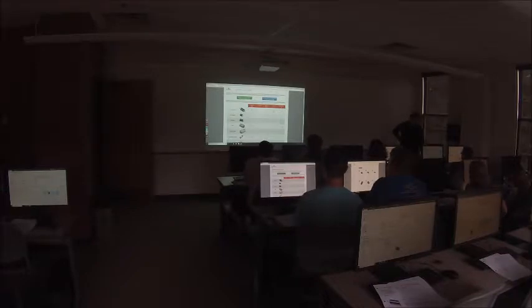Now, in addition to that, we want to know the free load current, basically how many amps of electrical current is drawn when the motor is just running at free load speed. As far as I know, that current basically represents the amount of energy that's just being lost in the motor to heat and to friction internal to the motor. Because if I'm not mistaken, if there were no resistance and if there was no friction in the motor, the free load current would always be zero.